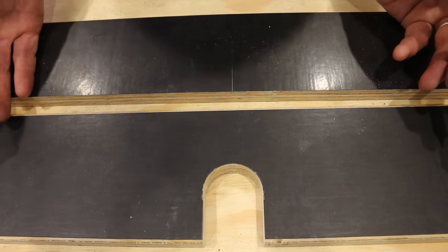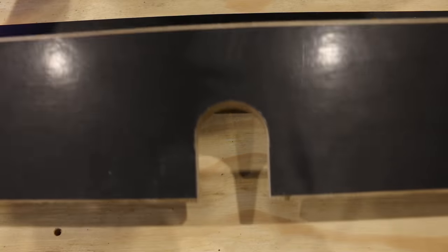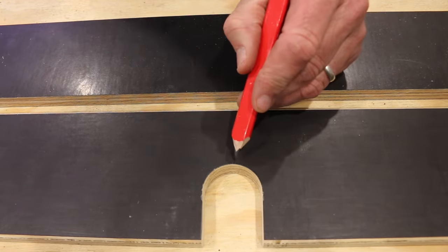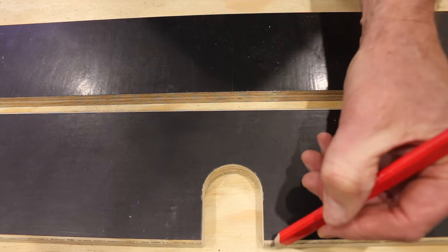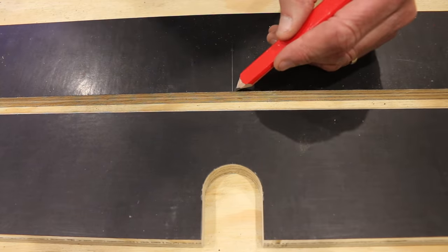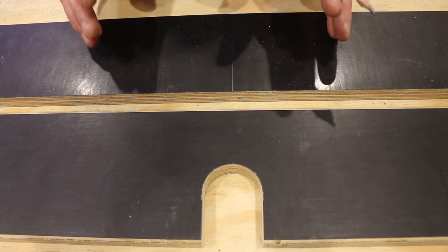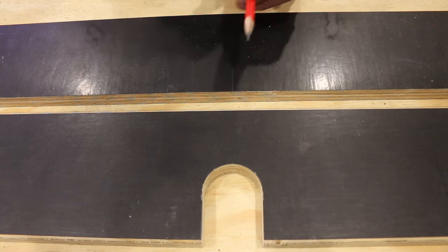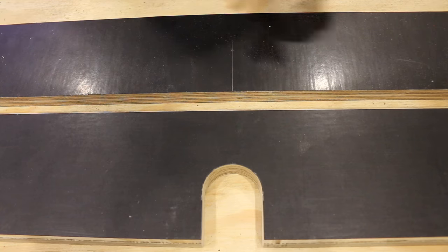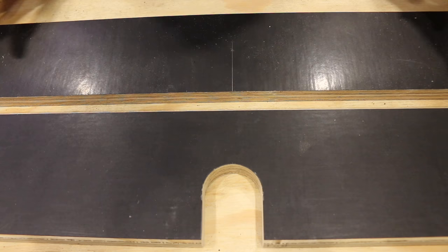Just a quick heads up: this is the back and this is the front. If you cast your mind back, we went up 60 millimetres from the top of the hole down to the bottom. I'm changing that on the back piece — instead of 60, I'm coming back 45 millimetres. The reason being, if I go back 60 all the way on the back piece, that's just going to weaken that board a bit, so I think 45 millimetres should be plenty.